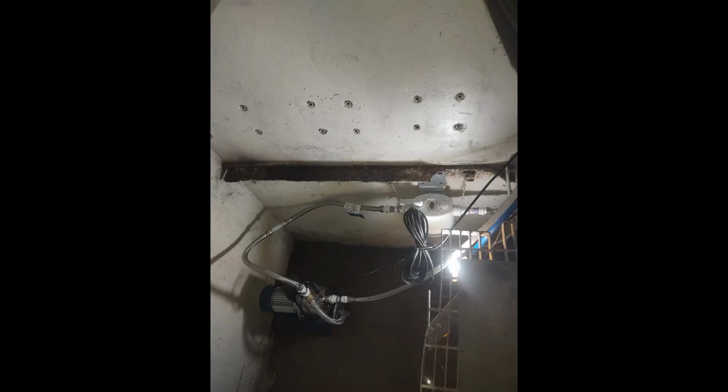In this photograph, we have a sump, and in that sump you can see the new jet pump we've installed, and then run it through a water filter from the tank up on the surface. Now what we found, we've got decent pressure without running the jet pump at all, but with the jet pump we can increase the pressure up to about 50 pounds per square inch.